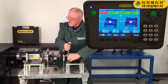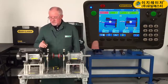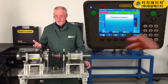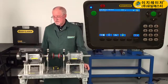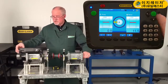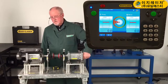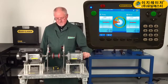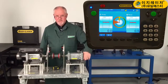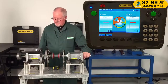You can see the horizontal has come into alignment, but we do need to re-measure. This button here — I press it and it prompts me. It says re-measure the coupling. I say yes. I'll start right there. I can start anywhere in the rotation, so this is good at any place. That's one reading. Come up to the top — there's two readings. I'm taking my time. Three readings.